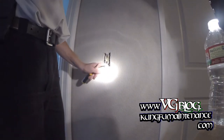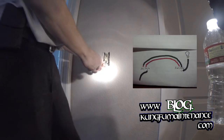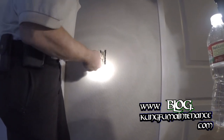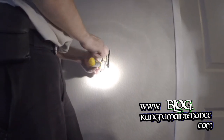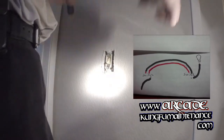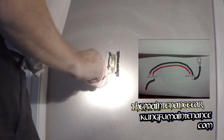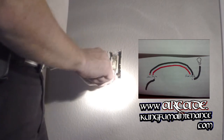The way this works is power comes in on one of the switches — on the bottom, or on the common screw. The power comes in there, and on the other switch, power goes up to the lights. It's got these two wires called travelers that bounce the power between both switches so that both switches work to turn the lights on or off.